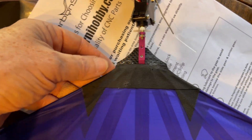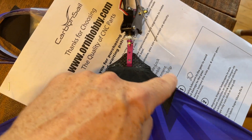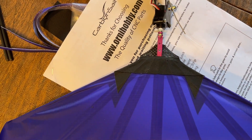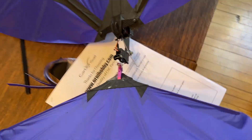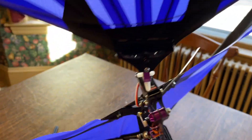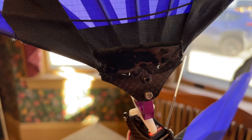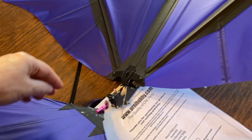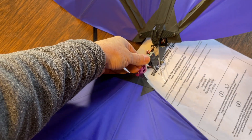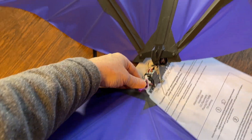I have had a couple of issues. One of the issues is that the spar that connects these tail feathers to this main plate — the glue joint came undone. To address that, I cleaned up the glue joint and added a whole bunch of epoxy to hold it in place. That also stiffened up these tail feathers, which is good because when you're flying you want to have real rudder and elevator authority — that's how you steer, by turning left or right or moving the whole thing up or down.